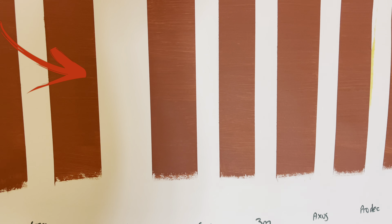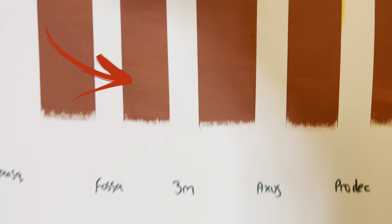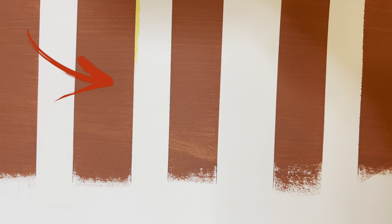Then we have Mask by Cirect — that is pretty solid. Next up is the cheapest of the bunch, which is Fossa — pretty clean lines, especially on the left. The right has a few rougher bits, but it performed very well for the price. Next to that is 3M, the most expensive — a little bit rougher than the Fossa, to be honest. So from cheapest to most expensive, you can decide for yourself which one's better. Next we've got Axis — that's pretty clean. Next one is the Pro Deck — that bit won't come off; it's not even been on there that long and it's stuck solid. It rips and it's just a pain to get off. So in my opinion, that's probably the worst tape in Test 1.